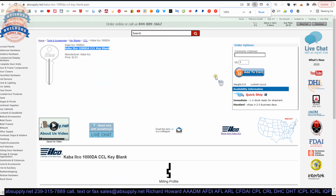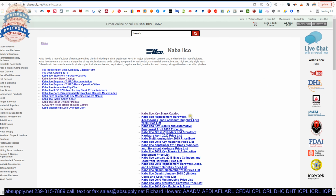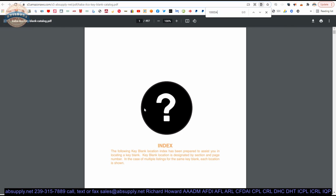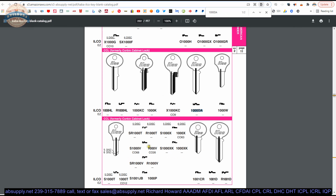So there is a link below this video as seen here. Before we click on that, let's copy our part number, then click on the manufacturer's page. We're going to open up the Kaba Ilco Key Blank catalog, and once that loads, do a Control F or find function on your keyboard for 1000DA, and you're going to get right to the CCL area of the catalog. Formerly Corbin cabinet lock.